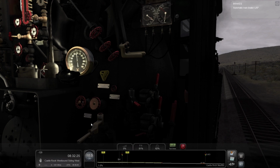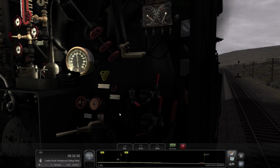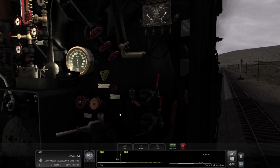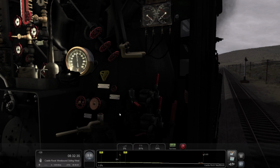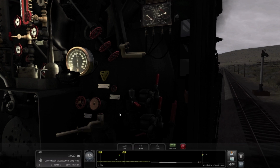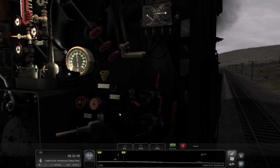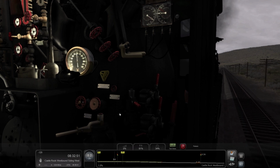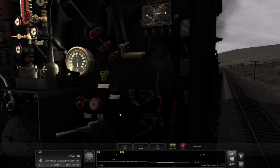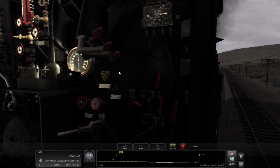I'm gonna get back into running. In the top of the diesel, that just converts all that electricity to heat and literally cooks off your speed. It's awesome. On electric trains, that same dynamic braking sends the electricity back into the catenaries, sending that for other trains to use along the line, and if nothing uses it, back to the power grid, which is awesome. And we overset the brakes because I was talking.